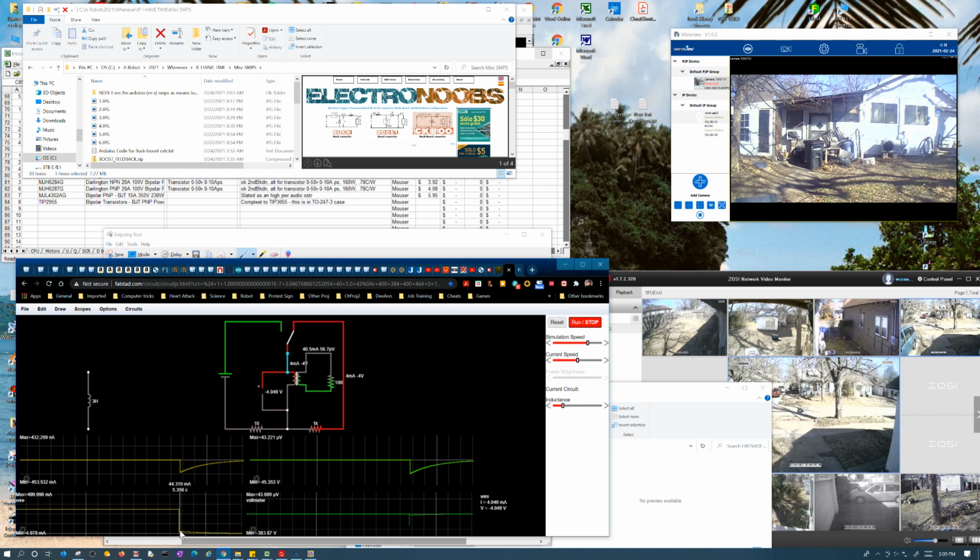Okay, but the rest of it's going through a load. Now, the 500 milliamps. So that's what I was suspecting, is that since we had half an amp going through the thing, I always wondered, and again, I really would prefer doing this without this load resistor. It's kind of confusing everything. But again, as I'll get to in a minute, I'll show you that this thing behaves kind of weird. But anyway, it's trying to maintain that, and normally it would have to try to maintain that through this 1K resistor. But because we've got this load on it, and it's a transformer, basically it's able to maintain that half an amp current through our load, instead of through this resistor.